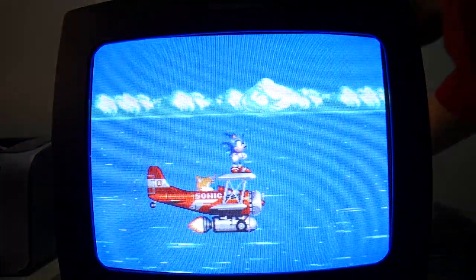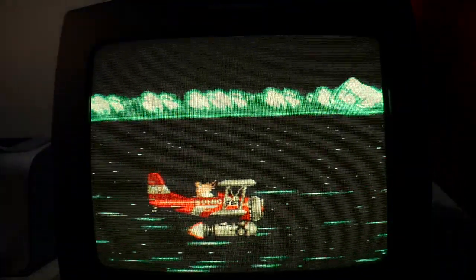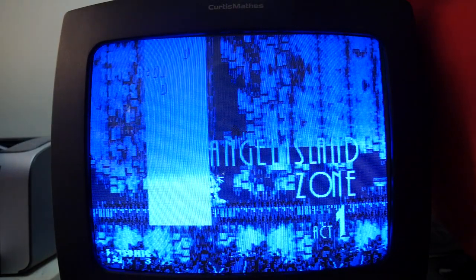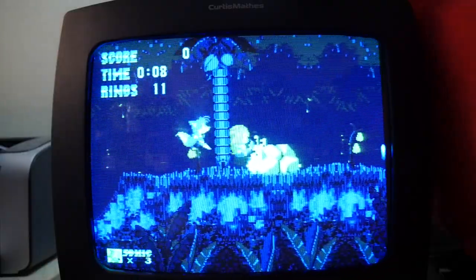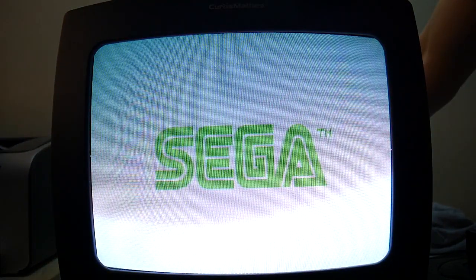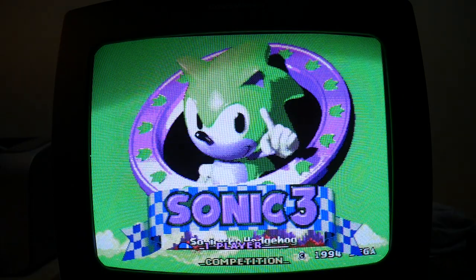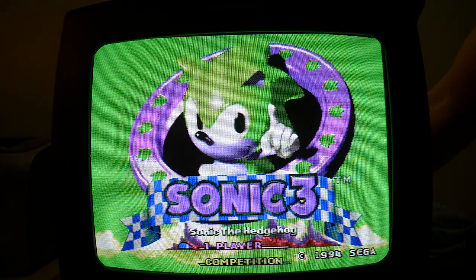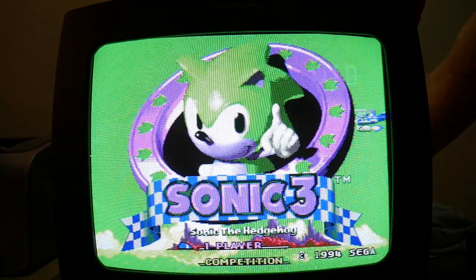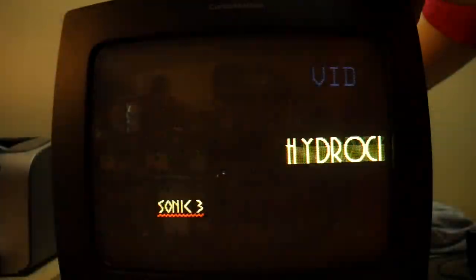When I first tested this, I had no idea if I did it right because this is a weird behavior to diagnose unless you play with it. This is when I'm triggering the blanking circuit with the wrong voltage, and I'm disconnecting each RGB cable one at a time — you can definitely see it's looking for RGB signals. If I plug in the RGB cables in the incorrect locations, the red, green, blue mixing gets all weird, and you essentially almost invert the colors. And that's another example of the mod working correctly for this TV. If red or blue and green are mixed backwards, or if I disconnect the sync signal, the screen just loses everything — so you need RGB plus sync.